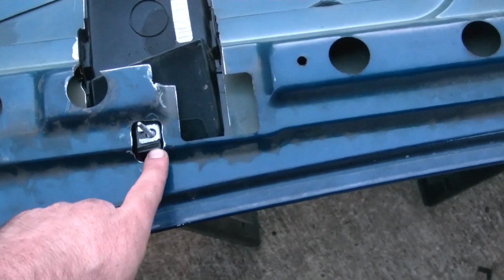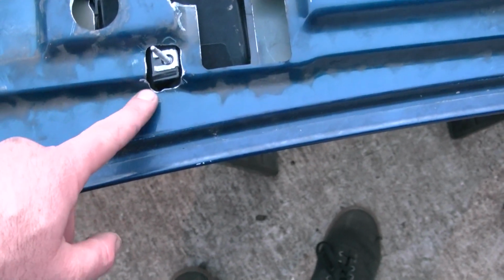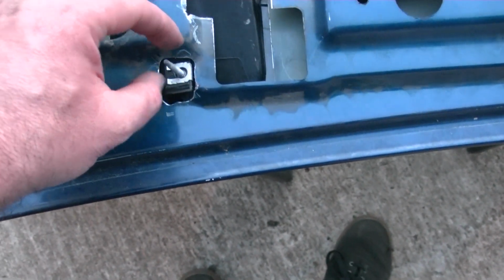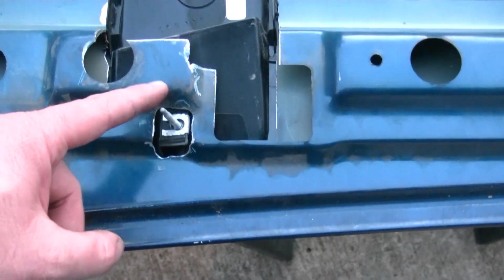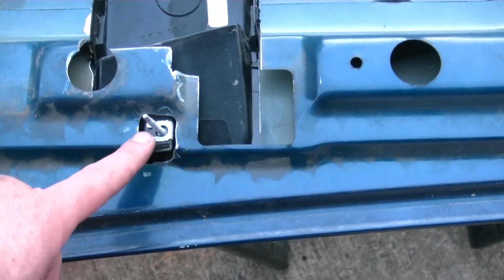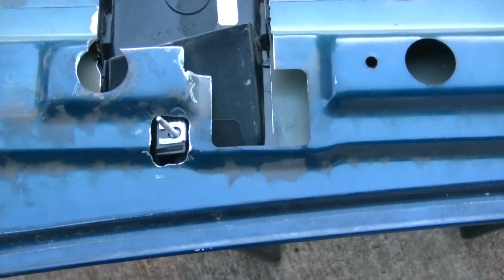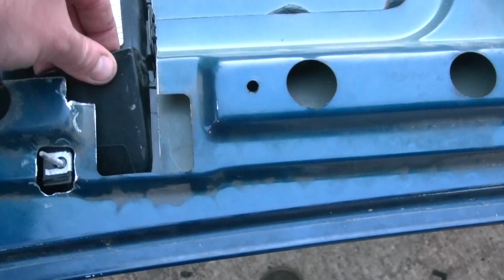Right here, this is on the vent itself. It protruded a little bit further than the hood, so I'll tighten the nut down. It also sits at a weird angle. I assume that's the angle of the Mustang hood. I'll tighten the screw down there with a washer under it, and I'll make a piece of metal that will surround that so it will fit and hold the back of it down and hold it from going front to back, because if this thing slides backwards then I lose my clip up here. So we gotta get that fixed.